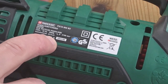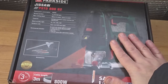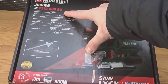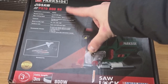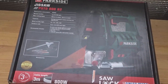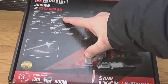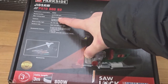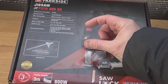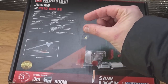On the label you can see it's an 800 watt device. Looking at the box, it is 800 watts of power — that's quite powerful for a budget jigsaw. I think I paid between 20 to 25 pounds for this, and usually you don't get that kind of power, so that's great. The max cutting depth is 80 millimeters of wood — so 8 centimeters — which is pretty deep. The current jigsaw I have is probably only good for a couple of centimeters maximum.